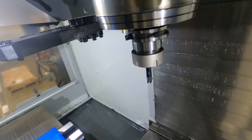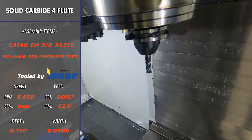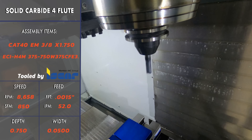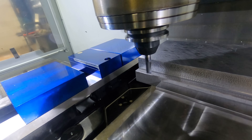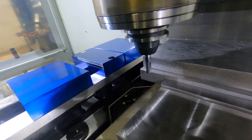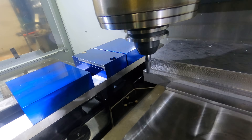The first tool we're going to use here is that quarter or three-eighths solid carbide end mill. We did program a little bit of relief into this - you can see we just milled that away real quick, so these tools have a little bit of an entry spot. We didn't want to risk breaking anything while we're trying to test this.